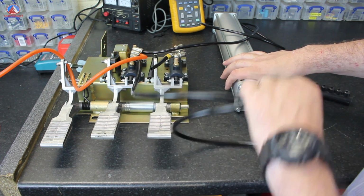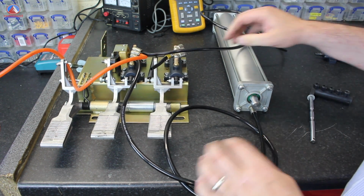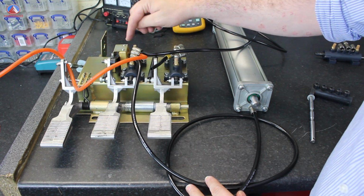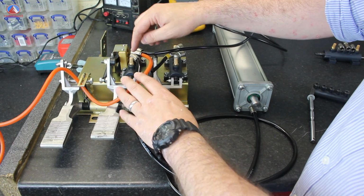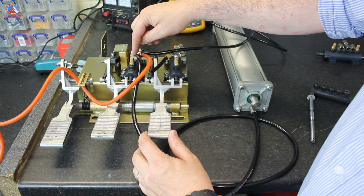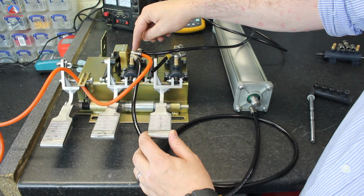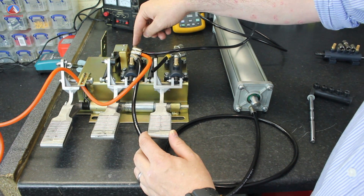The pipes are a little bit long. I've taken them straight off a machine. I don't really want to cut them, to be honest. And then you have 2 exhausts on either end. So you have 5 connections on this. 1, 2, 3, 4, 5. Exhaust out, to ram one side. Supply in from compressor, 4 out to ram other side, 5 exhaust.